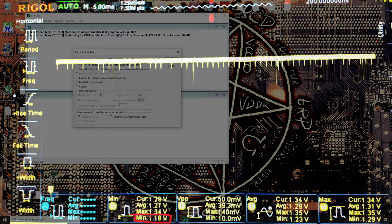So that would actually not be that difficult to figure out, but it would be annoying. It's an annoying thing to test, right? Nobody expects the higher switching frequency to make the voltage regulation worse. You expect it to make the VRM run hotter, but you don't expect it to make the voltage regulation significantly worse like that. Anyway, here goes mode 3 with 1.36 volts.